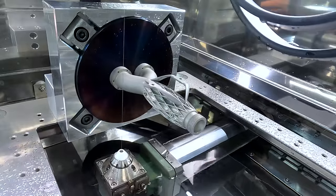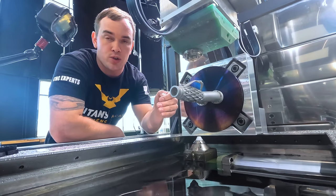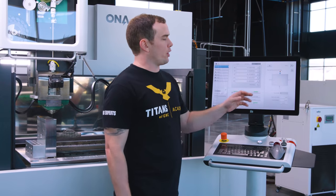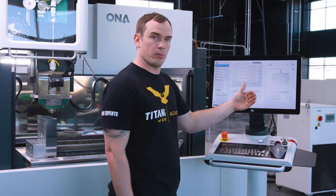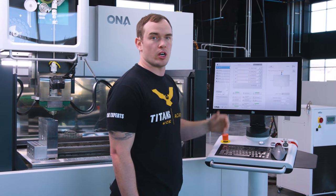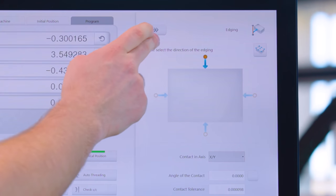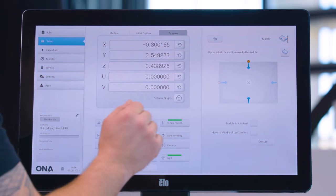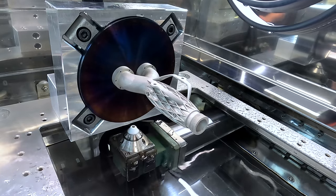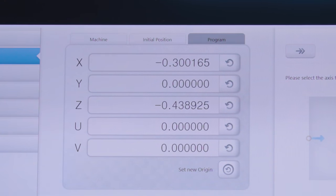Now our wire is moving in the negative direction and it's going to touch that back face. After that, we can cut our wire, and then we can move to the middle of our part for our Y origin. Now that we've picked up both our positive and negative locations in Y, we're going to go ahead and cut our wire and then use the middle function to move to the middle of those two locations and zero our Y. So now we've cut our wire — we're going to go into our control, hit our back arrow, and go into our middle function. We want to find the middle in Y, so we select this icon here and hit execute, and it's going to move to the center point of our last two pickups in Y. Our machine has moved to our Y center point, so we're just going to hit this here and that's going to zero out our Y position.